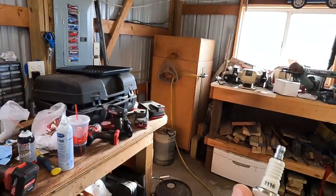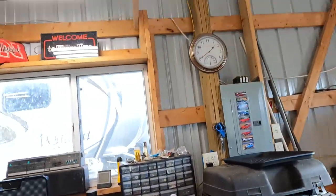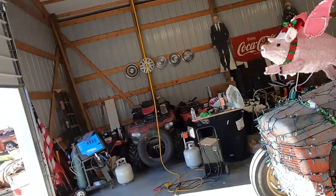So yeah, each one of these tractors, I'm quickly learning from reading and research, each one of these dang things has a mind of its own when it comes to air fuel mix, carburetor, and ignition. And just because one thing works in one person's tractor doesn't mean it's going to do you a dang bit of good. So out with the 3116. That's a waste of $12. We'll keep them around in case we need them down the road. We cleaned up the stock ones that have been in there for who knows how long, and she runs like a champ. So let's give you a little start.